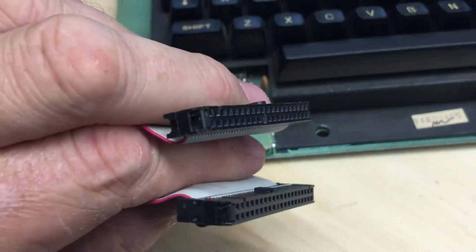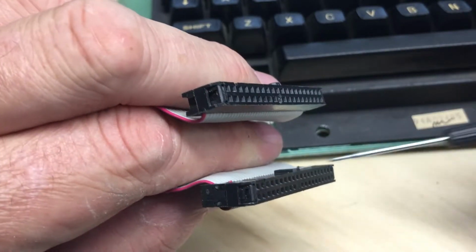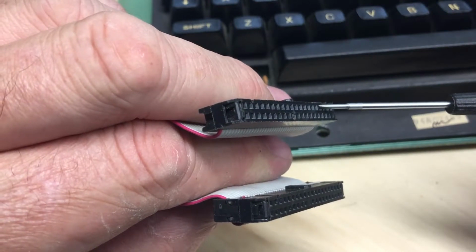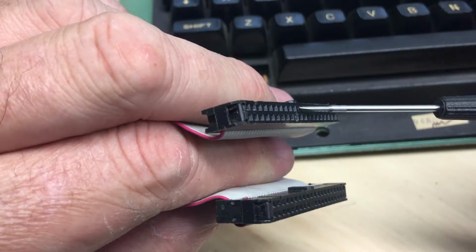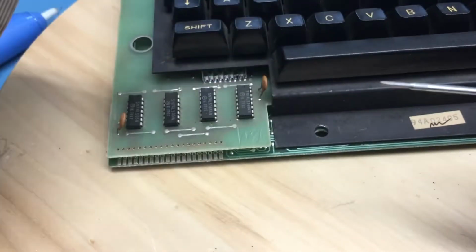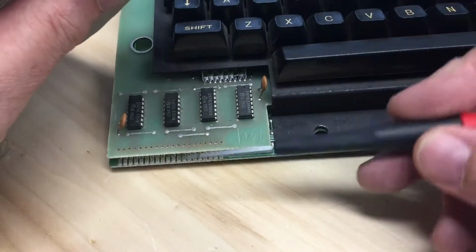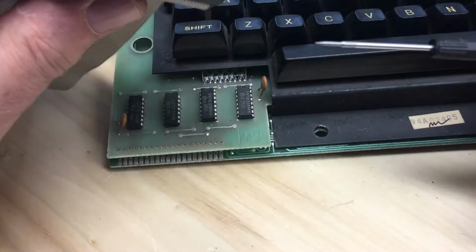So another consideration is if the cable was attached this way, and the printed circuit board was, say, on this face, this row, oh, I got to think about this. This row, does it become that row on the other side or that row? Boy, I'm going to have to break the ohm meter out and think about this a bit. In what I saw on the web, the other guy that used an IDC style cable had to use the upper row on one side and the bottom row on the other where there was continuity through.